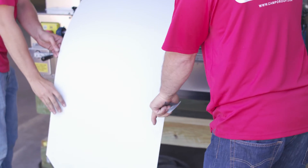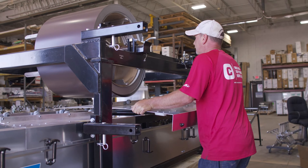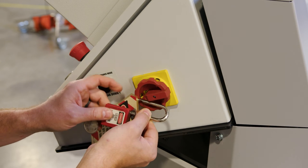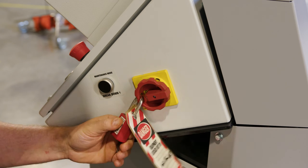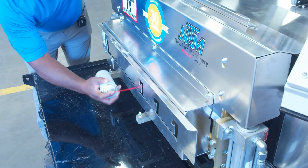When we talk about training, the safety aspect of the machine is number one. You need to understand where proper guarding should go, how to operate the machine with proper safety measures — lockout/tagout, all that. That's critical for anyone near the machine. After that, it's maintaining the machine. You don't want to buy it and let it sit for six months without opening it up and making sure all the parts are functioning and cleaned correctly. Training, safety, maintenance — those should be the three things on your mind right out of the gate.